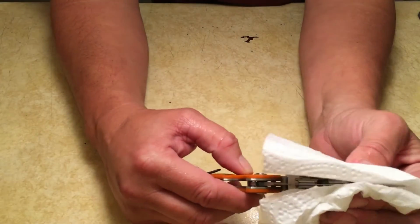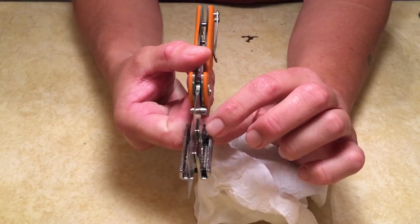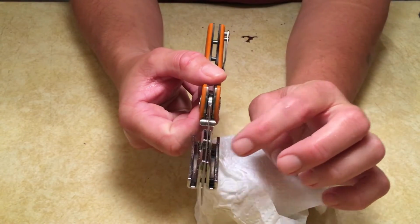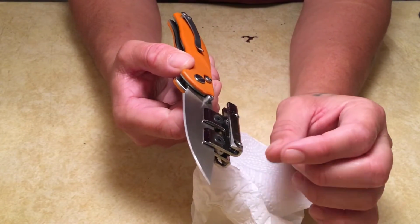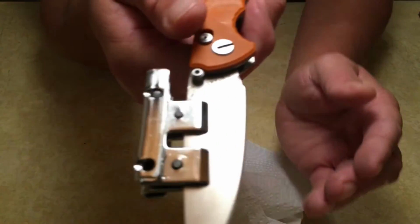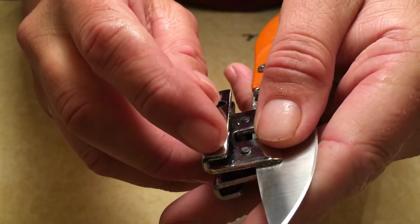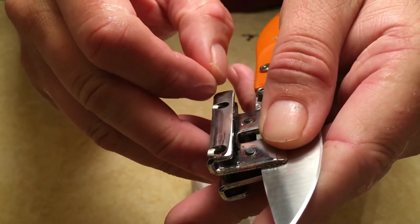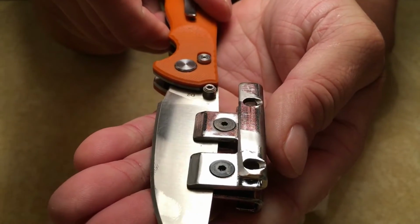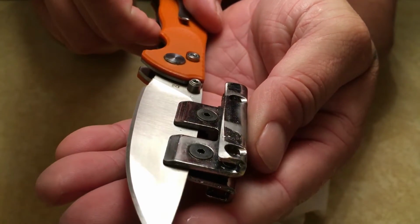Grit contamination can be an issue with these. As you grind, metal swarf and stone grit can develop and pack inside of the clamp itself, so that's something to keep an eye out for. If you see it, you definitely want to rinse it out. Also, I want to show you this wear already on the clamp itself. As you can see right in here, from that 240 grit stone, lifting up, hitting that tip, has already put some pretty substantial wear marks on the clamp itself.